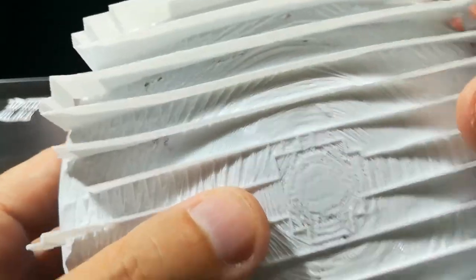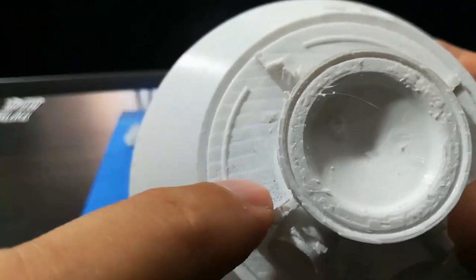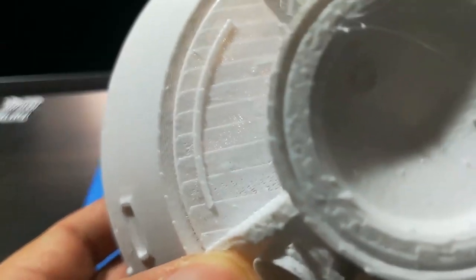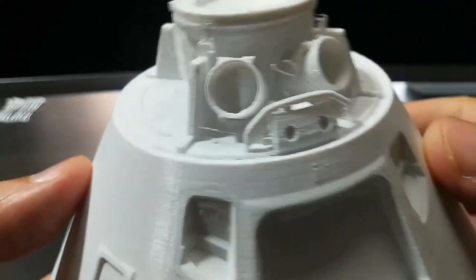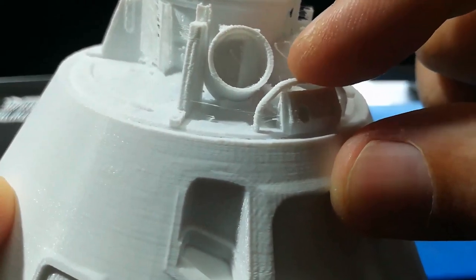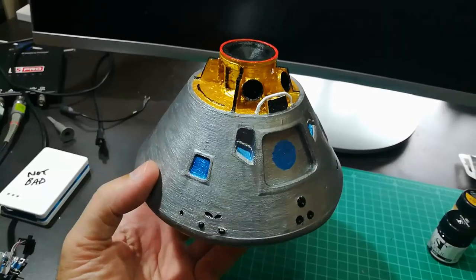Except it's a bit rough on the bottom — you can see the stringing, because I spaced the supports maybe too far apart. On the top, I only specified four layers of thickness where it's a terminating surface, so you can see some thin spots. If I shine a little flashlight through it, the light comes all the way through from bottom to top. But I'm amazed that this bar, which has no support whatsoever — I didn't even notice it in the model — printed perfectly. It's super fragile, but it printed fine.